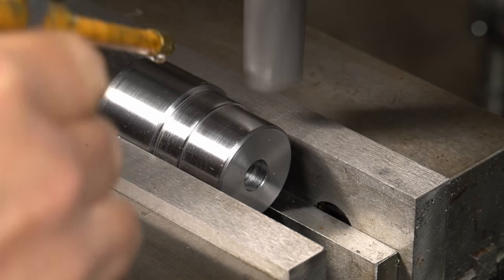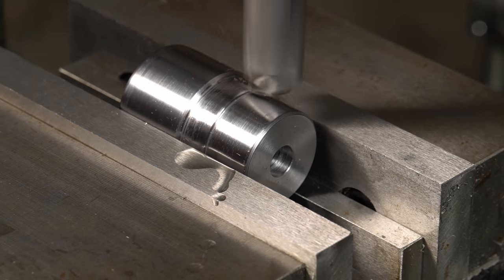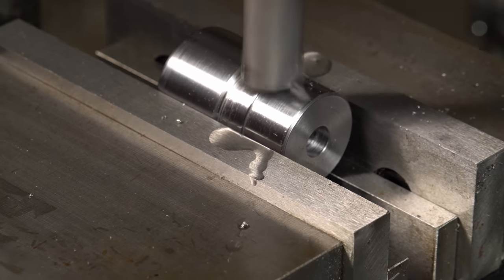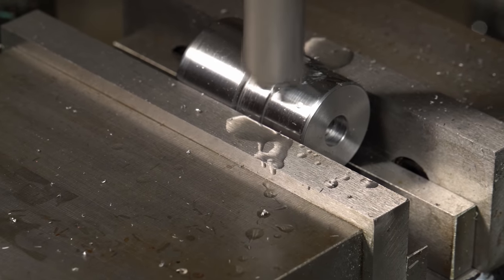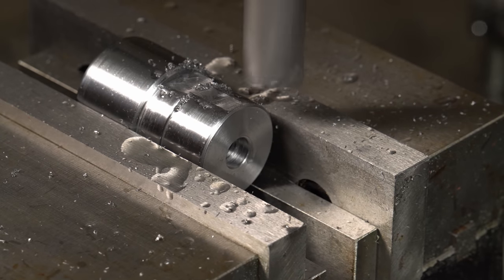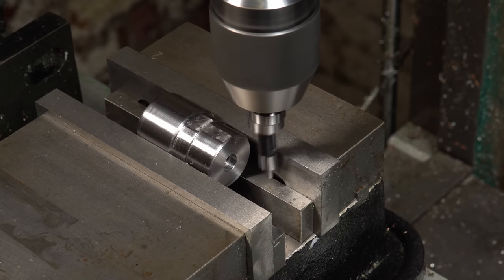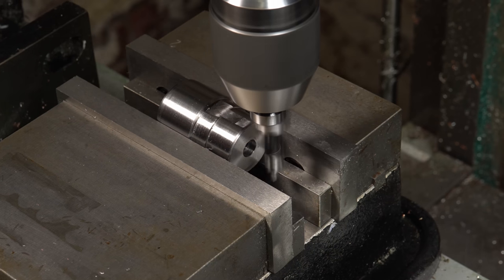It needs a flat on the side of the cutting head to make it easier to get the hole in exactly the right place, so I'm using the same rather worn carbide cutter to form the flat. I'm using a trusty old friction edge finder to centre the spindle so I can drill and ream the 8mm hole for the cutter. The odd thou, mil or bunch of micrometres doesn't really matter for this application.